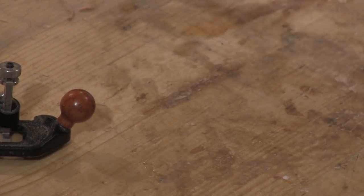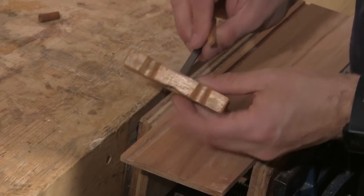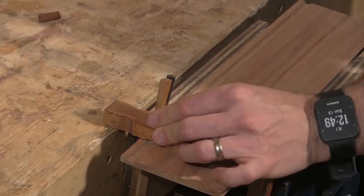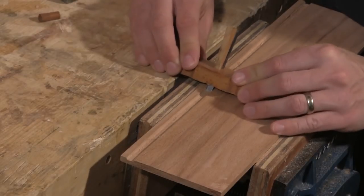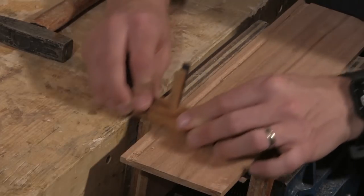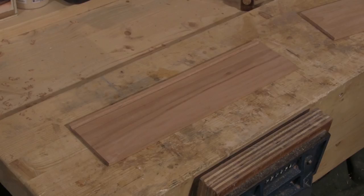Here's a cheaper alternative — just a piece of wood with a wedge and a blade. It's not really necessary for this job but I'll show the principle. The blade is set to depth and then the wedge tapped in. By planing along the length of the housing or dado, we can ensure it's the same depth all the way across. This is a little bit more fiddly than the expensive router plane, but if you have a job that absolutely needs a guaranteed uniform depth, this is a nice cheap way of achieving it. However, for this job it isn't absolutely necessary. And that's the housing or dado completely cut and ready.